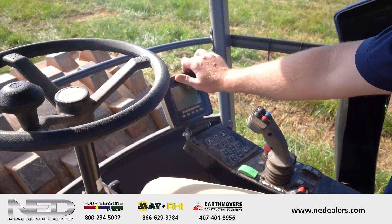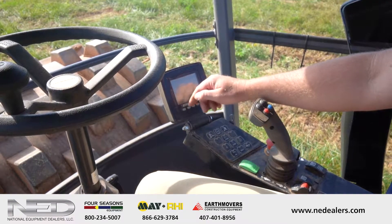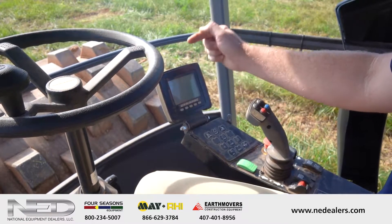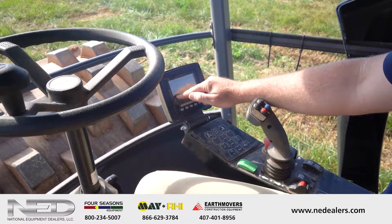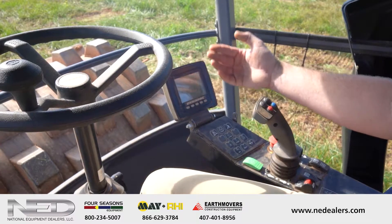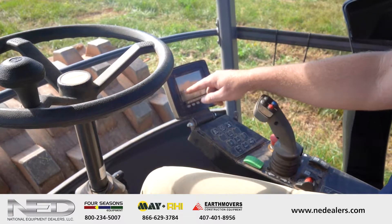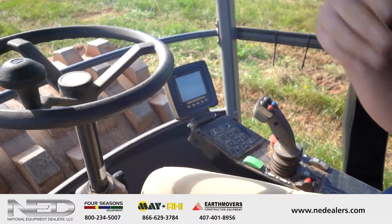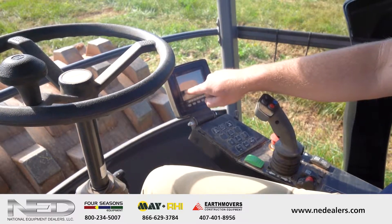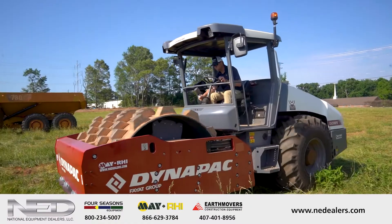To know the seismic is working, over in the left-hand part of this screen, you'll see a hertz reading, which is your frequency. In uncompacted soil, you're probably going to be somewhere around 30 to 33 hertz. You'll see that number start dropping as you roll. Eventually that number is going to plane out somewhere around 20 and it's going to stop. Once it stops at around 20 to 22, you're going to know that lift is done and you're ready to go to the next lift. So after your first lift, you know you're going to 22 — you'll look for that on your next lift. The second it hits 22, you know it's compacted and you don't have to keep going. If the material changes, you're going to have to make sure the hertz doesn't go down past that 22. As long as you're in the same type of material, you just set that one reference point and look for that each time. It takes the guesswork out of it.